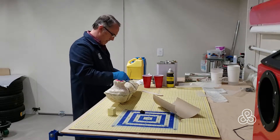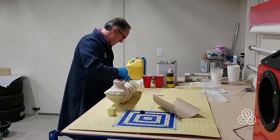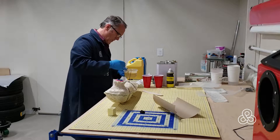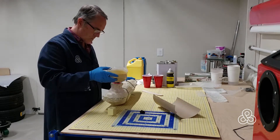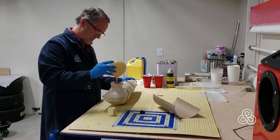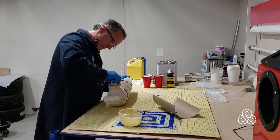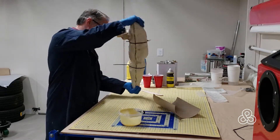This is a two-part urethane, and this is expanding foam — a one-to-one ratio. Once it's mixed up, you have about the same mixing time, about three minutes, and if you go that three minutes you might be seeing it foam in the container. So get it thoroughly mixed, then pour it in the hole, put our silicone plug in the hole, and rotate it around to get it to coat the entire surface.